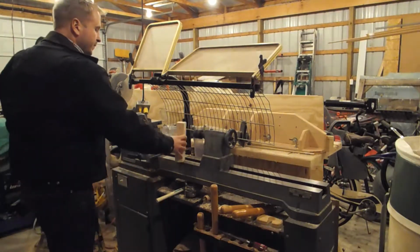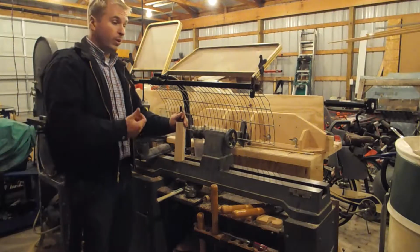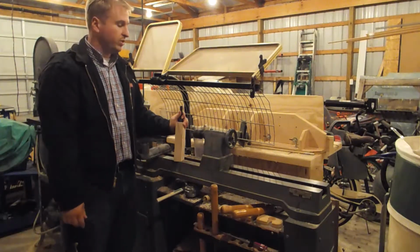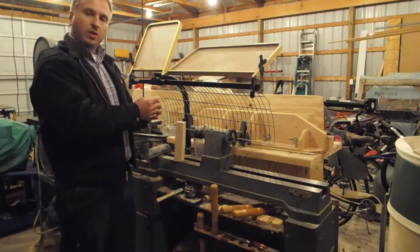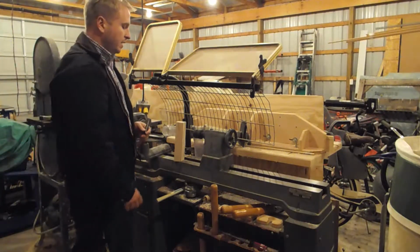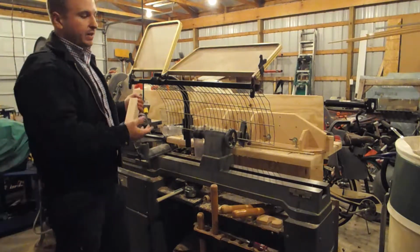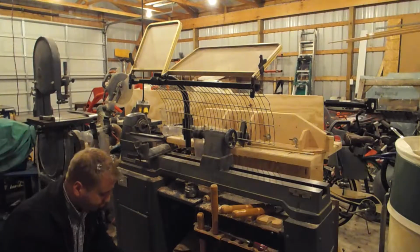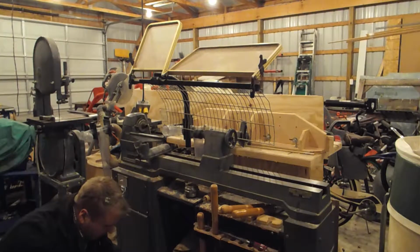Now, again, I have a lot of students that will set it up in the bed of the lathe, and they go ahead and try to hammer this in here with a regular hammer or something like that. Don't ever pound on a cast surface, so we shouldn't do that. Secondly, you don't want to hammer on these with a regular hammer. They will peen over this edge, and it will eventually get to the point where it's hard to fit that Morse taper in tight. So use a rawhide hammer, a rubber mallet, a wooden mallet, something like that. And I always just tell everybody, hey, just go down to the concrete floor and go ahead and tap this center in. Get it lined up as close to the center as possible.